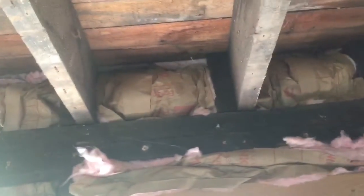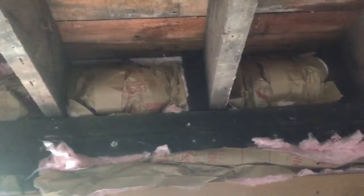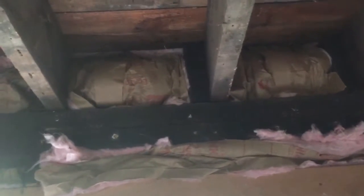So this side, this is the corner right there that's being lifted. You should see the floor joists are on also a, what is that, a 1x6, and they also are nailed into the studs. And the nice thing about the studs is that it looks like they go all the way up. Yeah, they do. These are balloon walls. That's why I was able to go up, and you were able to see all the way up to the second floor, all the way through the balloon walls.